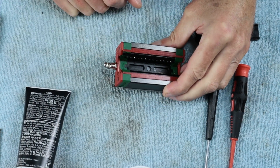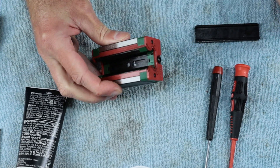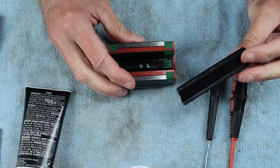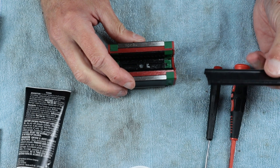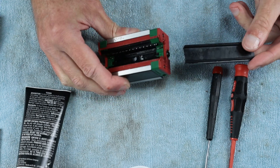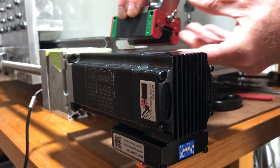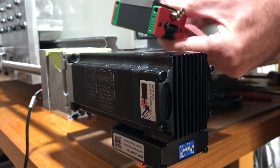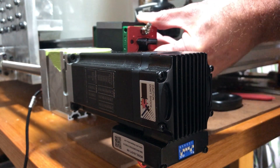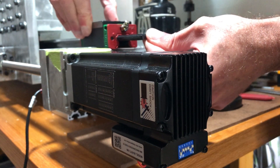Both seals are on now, the grease nipple is back on, and the plug screw is back on. You might be familiar with this tool — it's a keeper. The piece sits on the rail, and when you slide it in be careful not to drop a ball out. Now we're going to use this to slide the guide rail onto the rail itself.